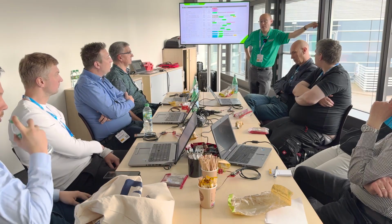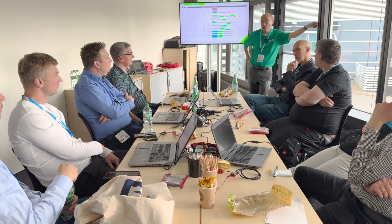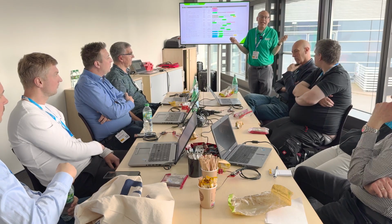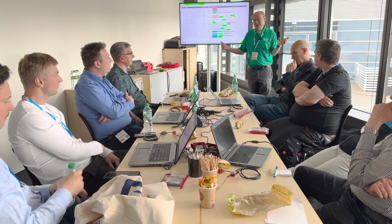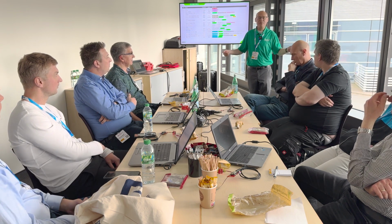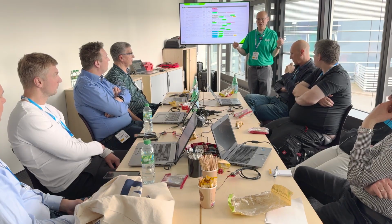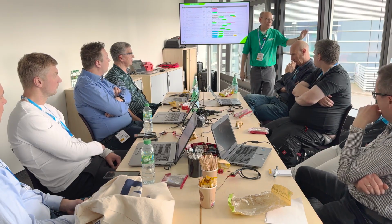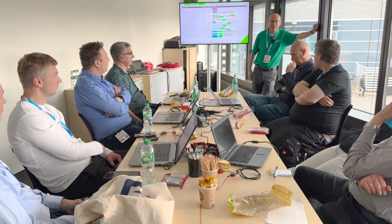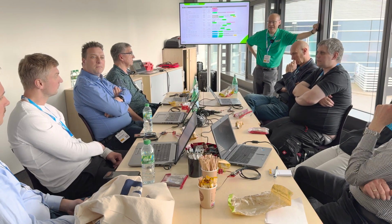For working with microcontrollers, the simplest XBee to work with is probably the plain 802.15.4 one. People use those for cable replacement often because you plug a UART in one side, a UART in the other side, and without configuring the XBee at all, they'll just talk to each other. Not necessarily in the most efficient way, but it'll work. So it's very fast for students to get going with something like that. The interesting part is something a bit more advanced. Yeah, and then you can work in from there into lots of stuff.